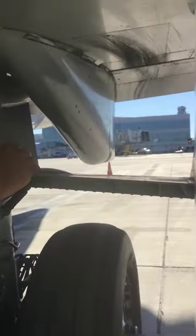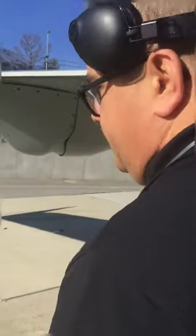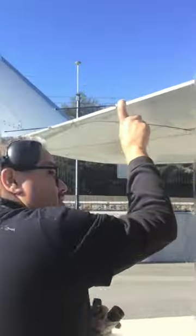Up in the wheel well — up in this bin, which will come out if you need to access some of the hydraulic components. When you come in here, it's pretty roomy. All you're making sure is that everything's secure. If it's a little dark, you'll need better light. This bin does come out — right now it's a good bin, no hydraulic fluid. I'm back out at the trailing edge, continuing to look at my fairings and trailing edge, shaking my fairings, shaking the spoiler, making sure all the static wicks are there.